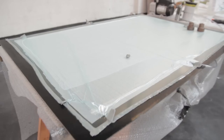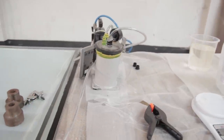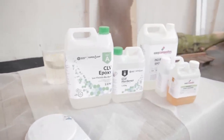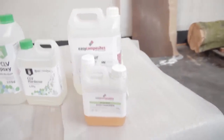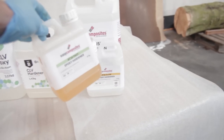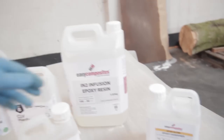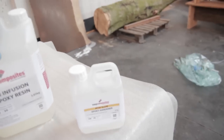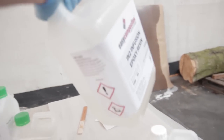What I did was repeat the same process with exactly the same layup, but using the IN2 epoxy resin with a slow hardener — you can see it here on the right. The IN2 is a regular epoxy, not bio-based, but I just wanted to progress in the process and try to make the honeycomb core and finish the project. It is very possible to swap resins going from a bio epoxy to a regular infusion epoxy.